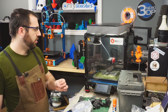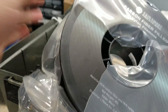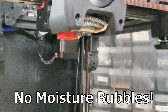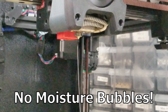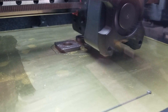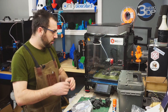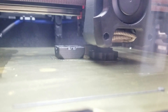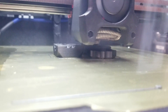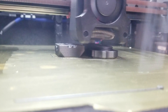With that all set up, you go ahead and seal everything up, run the filament to your hot end, and you are good to print. I was lucky that this roll of filament came relatively dry out of the bag, so I didn't have to run it through a dehydrator before printing. I've now been printing for several days with no moisture issues at all — no bubbling, and everything is still coming out quite well from the extruder. This is Sainsmart CF nylon, and printing it was actually a relatively straightforward process. I swapped out the nozzle to a hardened nozzle, printing at a 75-degree bed with 275 on the nozzle, and a little glue stick on the PEI to help with adhesion and prevent it from bonding to the PEI itself. So far everything is printing quite well.